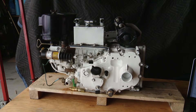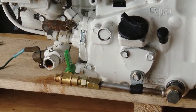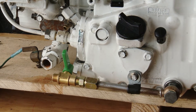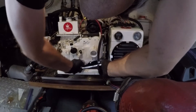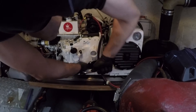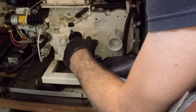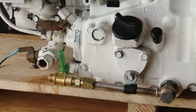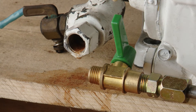About $200 of the parts and labor was to install an oil drain valve. The way the engine was installed on the pan in the engine room, due to the low headroom and available space, the drain plug on the lower right — which is also an integrated oil screen — is long, maybe four or five inches. When I pull that plug, I can't get a tube or funnel between the pan and the engine to catch the oil, so I had to let it drain into the pan and sponge it up with absorbent rags — awful messy. Now they tapped a hole through the oil plug, put in a tube assembly with a valve and threaded fitting, so I'll be able to use my cordless drill-powered extractor pump to suck all the oil out of the genset just like the main engine.